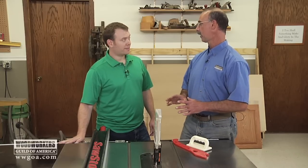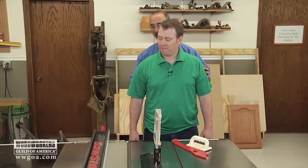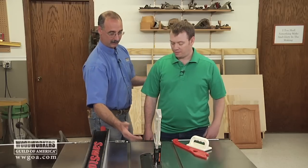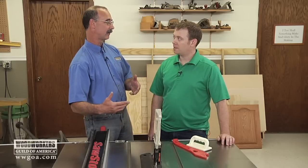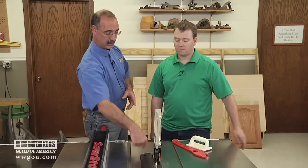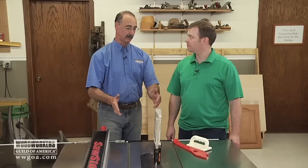Body position — you are in perfectly the wrong spot right now. When you stand here, you're directly in the line of kickback from the table saw blade. Kickback is when the blade has the opportunity to grab a chunk of wood and throw it out pretty violently. The rim speed — the teeth on a table saw blade are going about 150 miles an hour. So I'm not trying to scare you off, but the reality is if those teeth grab a chunk of wood and throw it back, it comes back really fast. What I tell my students is use these lines on the table — your miter gauge slots — as a guide of where you should not be. The danger zone is any place in between these two lines.